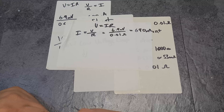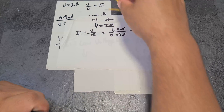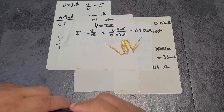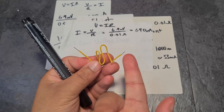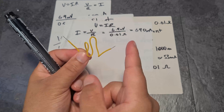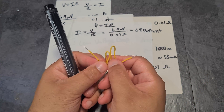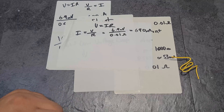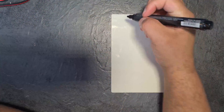The great thing is, with my solar charger kit, I could use a shunt like this, stick an Arduino on it, and use the Arduino to measure the voltage across it. As long as I have the voltage across it, I know the current flowing through that part of the circuit — I can stick it anywhere. It's just so simple. You thought Ohm's Law was useless in school — pretty useful, right?